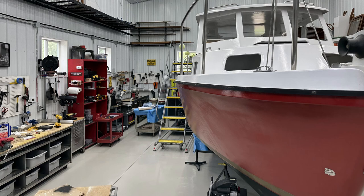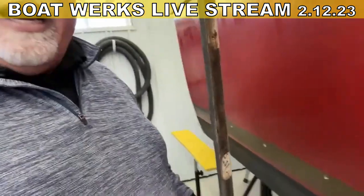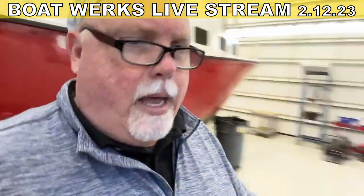The hull of the Albin 27 above the waterline is somewhere between 10 to 12 millimeters thick — about three-eighths to half inch. You really don't want your rubbing strakes screwed into the hull, because the idea is they're designed to be sacrificial. If you crash into a dock, they're supposed to be damaged and destroyed and replaced over time. But when they're screwed in, the rubbing strake can be torn off and also damage the hull. What you really want is something through-bolted to the hull, but removable and replaceable. This is what was originally on the boat and I've decided to upgrade it.